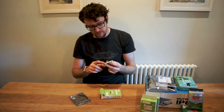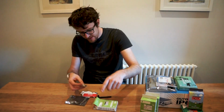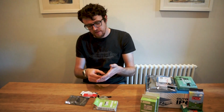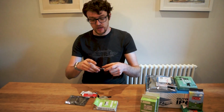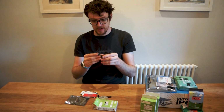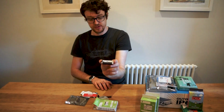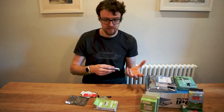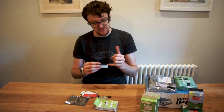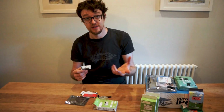with that together. We've also got in the box a bunch of accessories and mounting hardware and stickers and everything like that. But you'll see we've got this header. Basically, with the full-size Raspberry Pis, there are components in the way that would stop you from mounting this on top of it. So what you have to do is put this stacking header on, slots into the header there, and then that just gives it a little bit of a higher profile, which enables you to plug it on top of the Pi 3, Pi 4, Pi 2, one of those bigger Raspberry Pis that isn't the Zero. Now, it still is only about 10 millimeters away from the Pi, so it's not exactly a massive difference, but just not quite as low profile as with the Pi Zero.